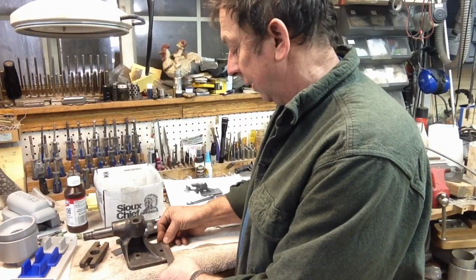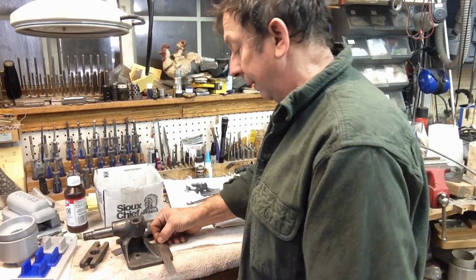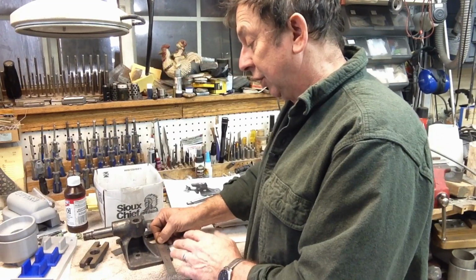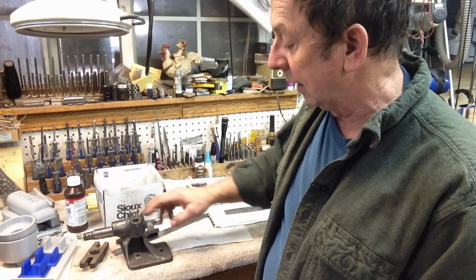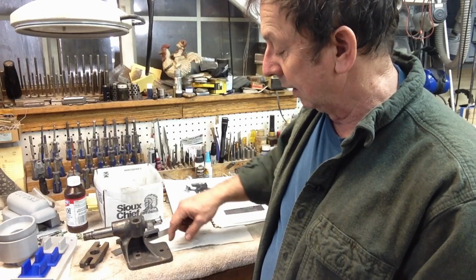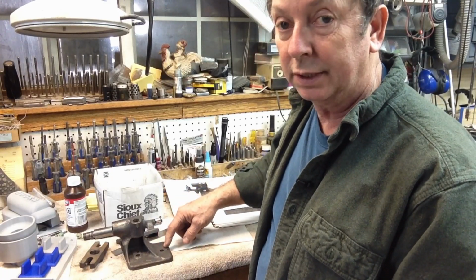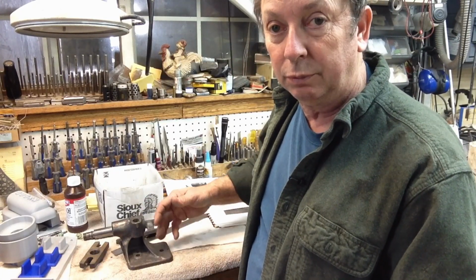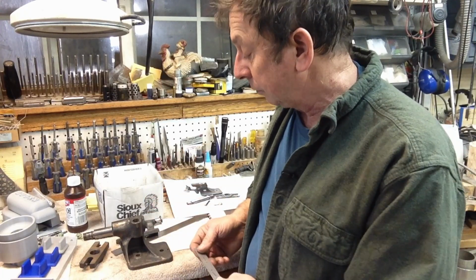So when I look at the finished dimensions on this one, and these are going to vary depending on when they were produced and what foundry they came out of, if they had more than one set of patterns. So there's going to be variations you see within the Atlas themselves. I have seen tailstock castings that have only one hole here for a hold down, but then I've also seen like this, like the headstock has, which has 2 holes in it. So there again, why there was a second set of holes or why there was only one, I don't know, but it's stuff that really is irrelevant.